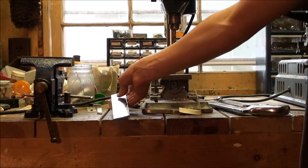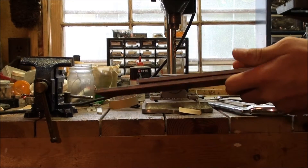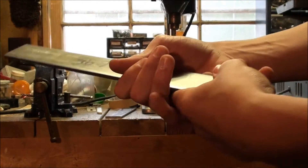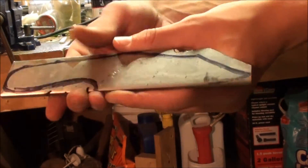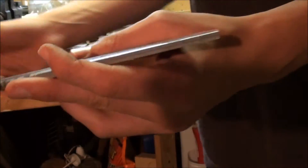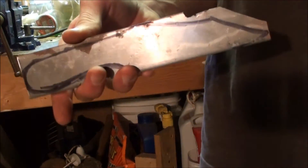This is 8 inches overall, so we have 10 inches left to make another knife. We'll save that for another project since it's 1095. It looks a little rough, but that's what the grinder's for. The main part we had to get off was this giant corner right here — you can see how big what we just cut off is. Then we cut a little bit into the handle right here to make it a little bit easier to grind.